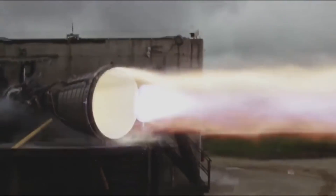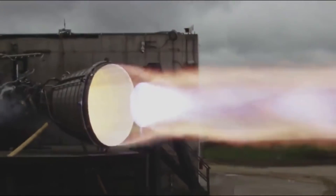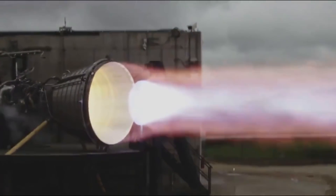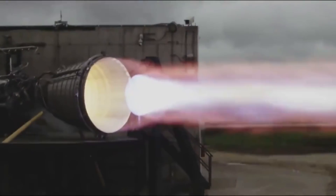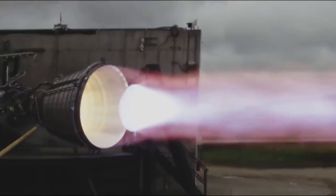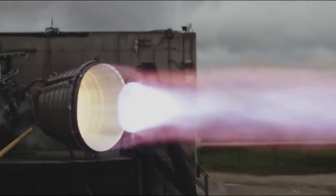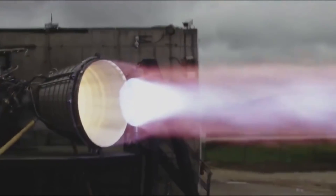When the engine is firing, you can see it has a very pronounced Mach diamond just beyond the nozzle, very similar to the one we see in the space shuttle. You can also see that as soon as the exhaust gases exit the nozzle, they get compressed down by atmospheric pressure, and as they get squeezed down, that's where you get that hot spot. It actually surprises some people that despite all the energy and violence, the exhaust gases leaving that nozzle at supersonic speeds are also leaving at lower pressure than the atmosphere around us. There are also some telltale bright beads along the interior of the nozzle — that's where the flow separation is happening.